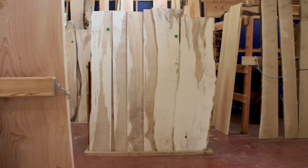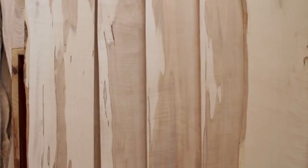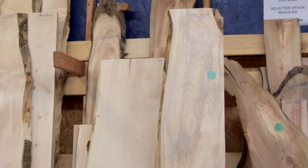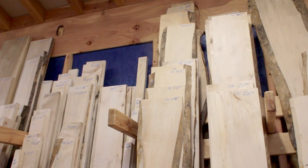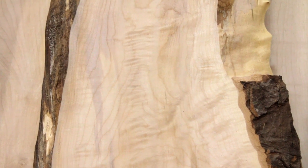Here we see some finished and planed boards. Sycamore is considered a relatively easy timber to work. It cuts and planes and finishes well, and is quite stable and less inclined to move or warp when subjected to moisture changes. It has a range of uses, such as fine furniture, kitchens, internal finishings, skirtings, facings, doors, and so on. You can also get figure in sycamore, known as rippled sycamore or fiddleback sycamore, and this gives an attractive pattern and is popular in the production of musical instruments and some fine furniture. You can also get tremendous grain patterns and lustre around big knots and forks in a board.